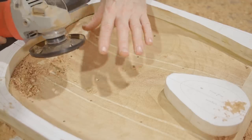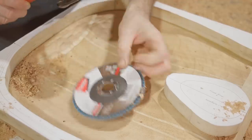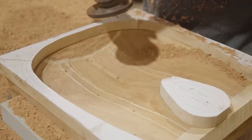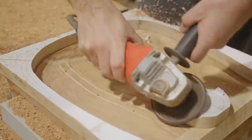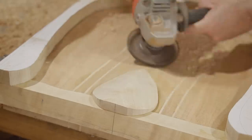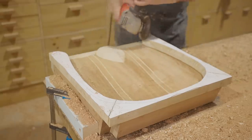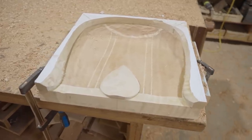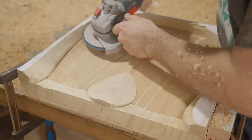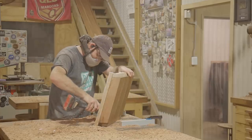I'm starting to see the bottom of some of these holes so I need to be a bit careful. This is starting to tear one or two bits up so I'll go a little bit further and then I'll put a flat disc on and finish it with that. It doesn't look the best at this stage but it should come together - next I'll use the 40 grit disc to start evening it out and blend it all together. The worst part about using the flat disc is it makes dust rather than chips but it still removes a fair amount of material and there's a bit more control. You could still dig in and ruin a piece but not as easily as with a power carving disc.